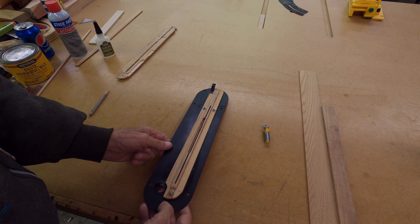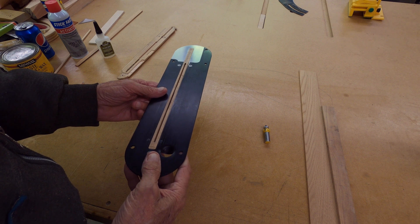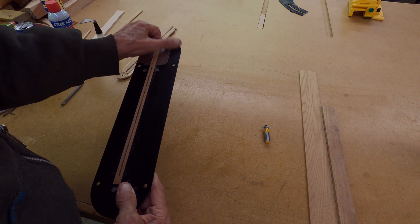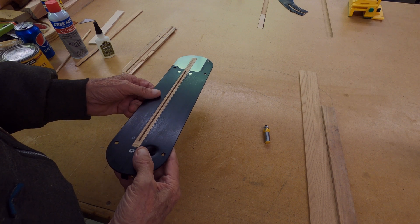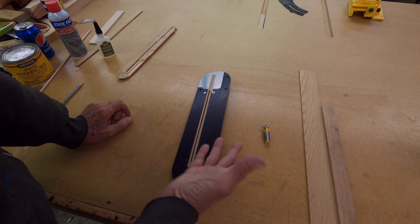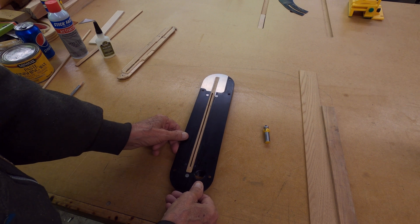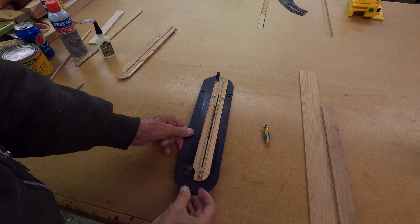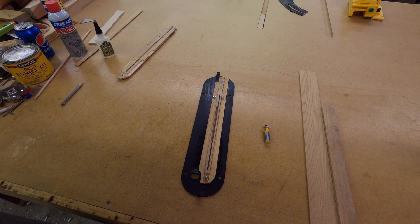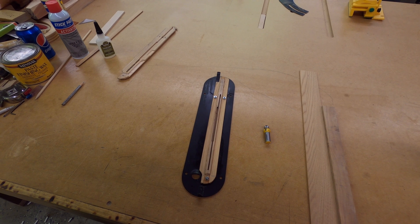That's about all there is to it. You really can't angle the blade because if you do you'll widen the slot — it'll be close but won't be exact. What I do is buy another plate; there's a parts replacement place on the internet, they're $24 a piece. I just got one made for the 45-degree angle, and a third one would be nice just for odd angles where you could just leave it out. It was pretty easy to make, as long as you don't mind it being glued on, which I don't. That's enough to show you how it was done — I wish I had the original video, it was a lot better. Anyway, we'll see you later, bye.